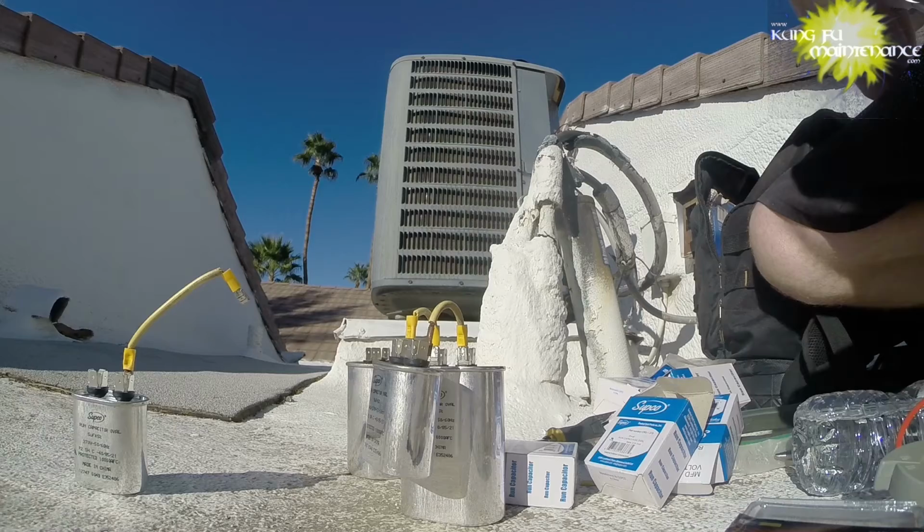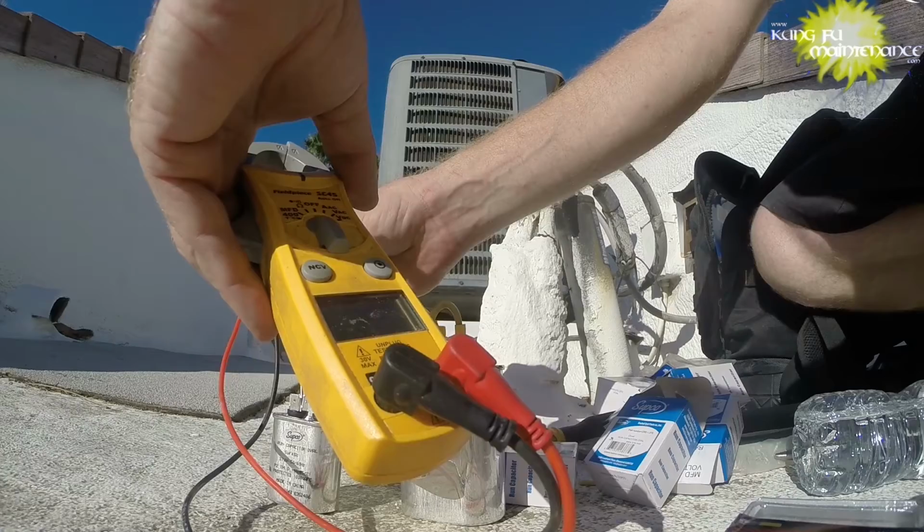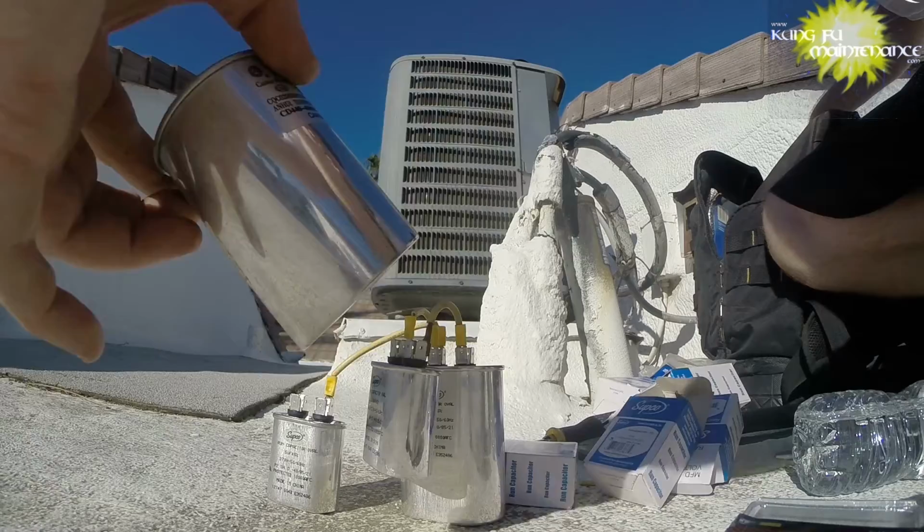And then here we're going to get our fan, which will be our 5 on this set. And again, it just makes its connection inside, usually from the fan side to the common. You just don't see it, but the wire, or the connection, is inside.